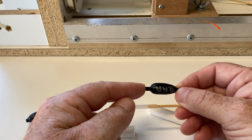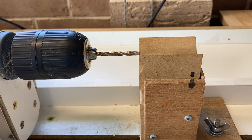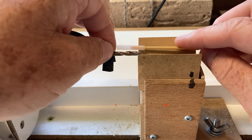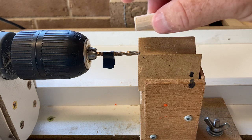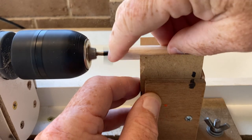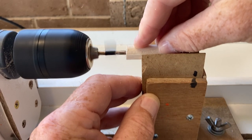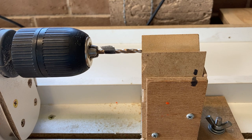To insert it, we have to drill a 4mm hole into the top of the body. I've put the 4mm bit in and I'm just going to put a piece of tape on at approximately the 25mm point, to indicate that I should go no deeper than that on any of these drillings. Bear in mind, if I'm drilling the small one, I don't want it to go all the way in, so I'll probably only go to about halfway.